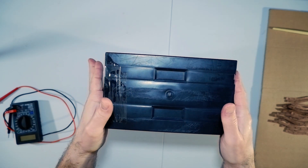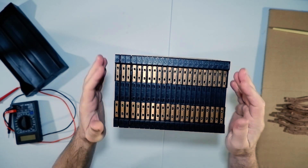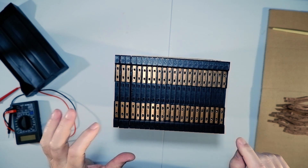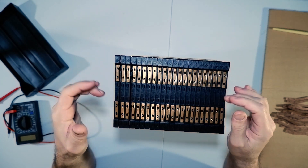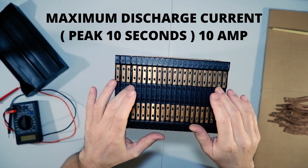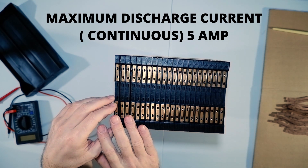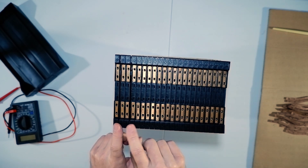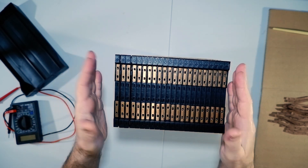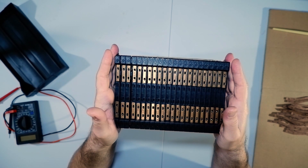The battery! So I got these flat pouch type cell batteries and there are 22 along here, so I'm going to have a 22-cell pack. Each cell is 10 amps maximum for 10 seconds and 5 amps nominal. That means it'll be 110 amps at the lower end and 220 amps maximum burst for 10 seconds.